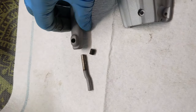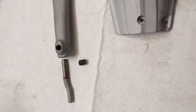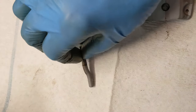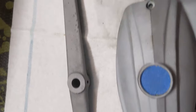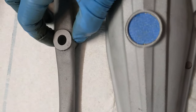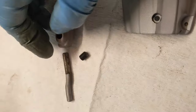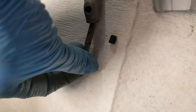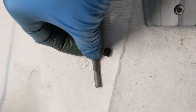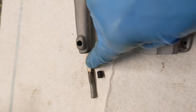I wanted to document the orientation — I pulled out this little nub, here's the set screw — because it's got a little curve that comes down. The way it was when I pulled it out was like this. So here's a little oil hole for the center on the bottom, and then it was like this. Now, it's kind of odd to me because the flat part of this shaft is on the top. I would normally think that the flat part should be lined up where the set screw is — like this — that would make sense to me. But it came off the other way. I'm going to try it both ways; it might have rotated. But to me it always makes more sense where the set screw comes up against the flat part.